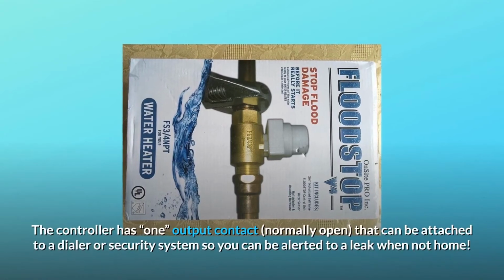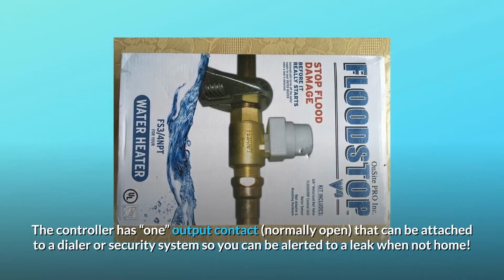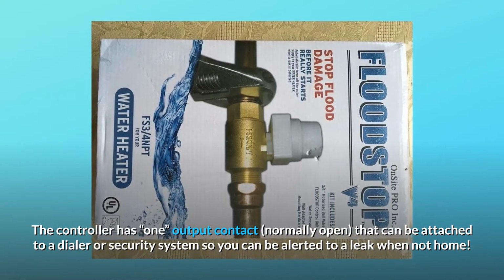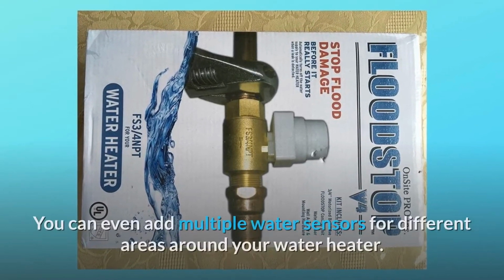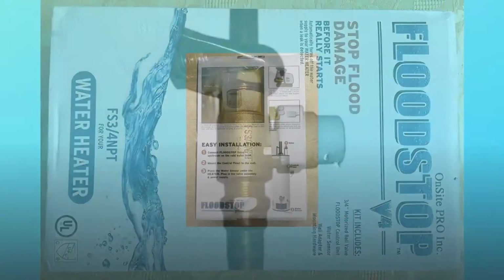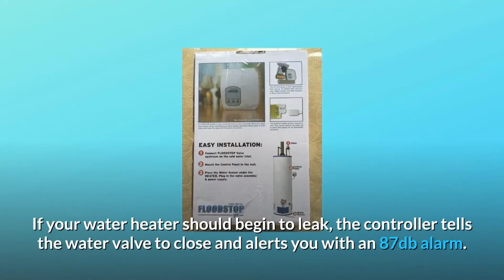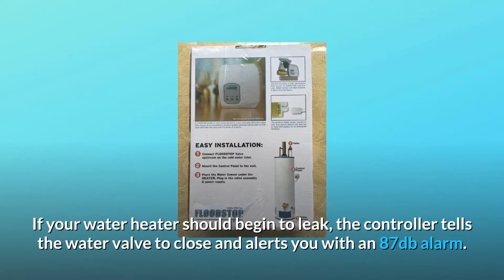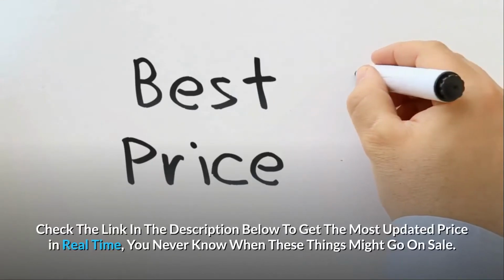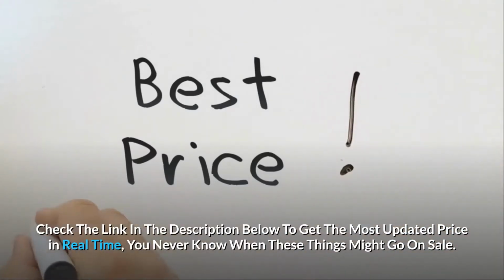The controller has one output contact, normally open, that can be attached to a dialer or security system so you can be alerted to a leak when not home. You can even add multiple water sensors for different areas around your water heater. If your water heater should begin to leak, the controller tells the water valve to close and alerts you with an 87 decibel alarm.